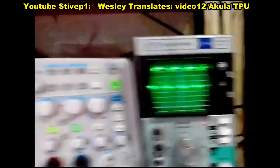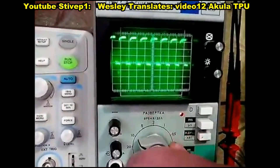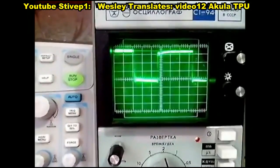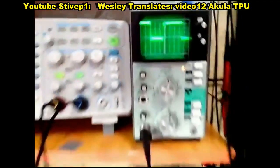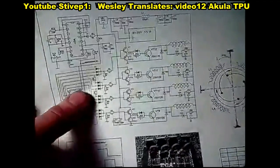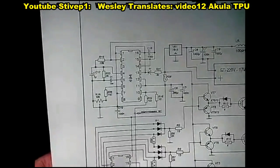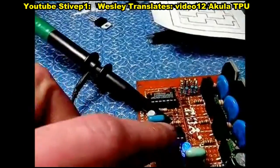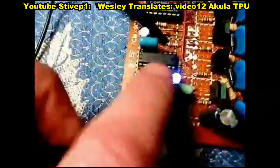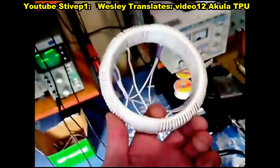417 — that's what we see, that's the graph. That's how it looks in a different time frame or time base. And that's what is on leg number 14 of the 494 chip, from the other side of the resistor — and that's where that one is located.